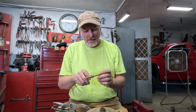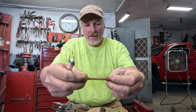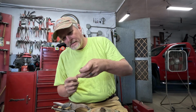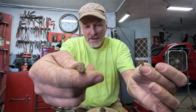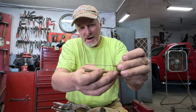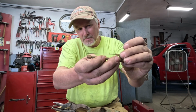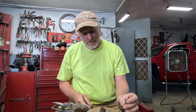We can pop this tube out of there, the pickup tube, so we can clean that up. There's that over there. There's a little rod and a spring in there. That tiny little rod goes down. I know I've told this on other videos before, but with the camera focus on that hole in the bottom of there, when you crack the valve open a quarter turn to light it, that rod is sticking out through that hole, and it's got that hole plugged so that you're pulling vapors in from these holes up here at the top, and those fuel vapors from the top half of the fount are what lights the lantern and gets it burning.